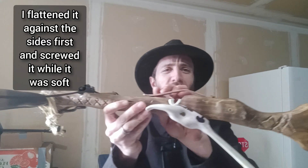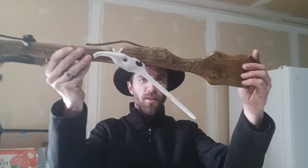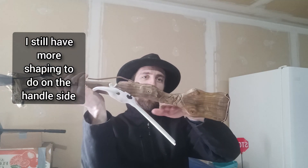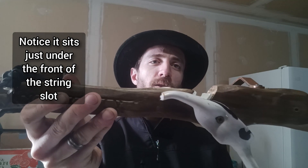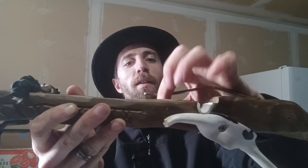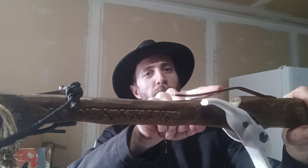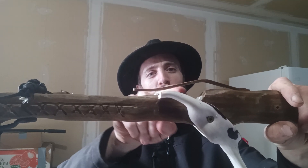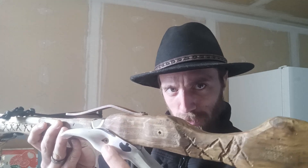I just wanted to show you guys where we are sitting now. I still need to change the angle on my lever here just to make it look cool, so it's not just sticking way the heck out the bottom of the device. I'm going to kind of curve this back gently against the stock itself. I've split my PVC like I was telling you guys, and then I've created an area under here where it can rotate down on itself. When that string's sitting in there, all you've got to do is put a little pressure here and these risers will pop that string right off. As soon as that string comes off it can slide in between those two ramps right there — there's just enough room between those two ramps to let that string fly and grab the bolt very cleanly.